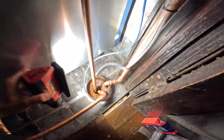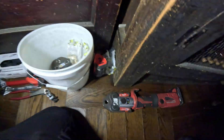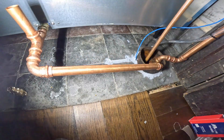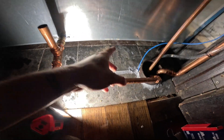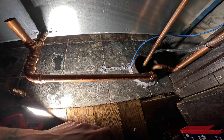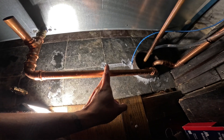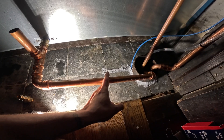The beauty of technology is that we're going to be using our press tool — the M18 Pro Press. We can make connections even if there's water in the line. If not, we'd have to dump the whole bin of ice — 900 pounds of ice — and I'm not really trying to get into that. So we're going to cut the pipes, add unions, so they can service this drain in the future. That's the plan.